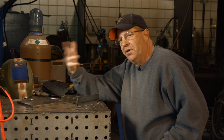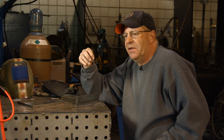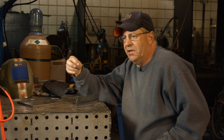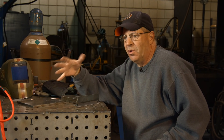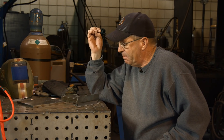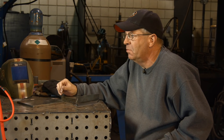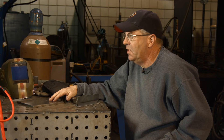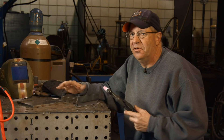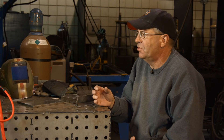We'll do a whole series on pulses and all the combinations. Basically, pulse is developed so that you can weld hot and fluid. The background amperage gives you a cooling or dwell time. You can weld some extremely thin metals, stainless, and do some fun stuff with it on aluminum. I'm just trying to introduce the whole concept of a pulse type mode on this particular machine.